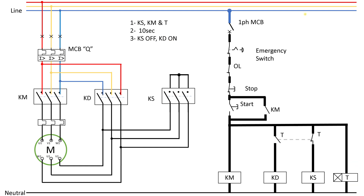But are we missing something? Is the control circuit finished? No — because the star contactor and the delta contactor cannot be energized at the same time. If we energize them simultaneously, we will have a short circuit: current will go here, it will go here, and all three phases will be shorted. This is a disaster — your MCB will trip and your panel could even catch fire.